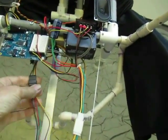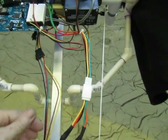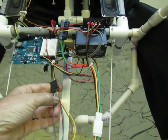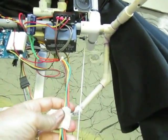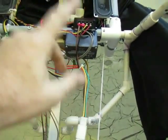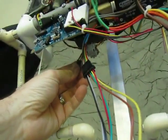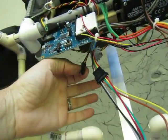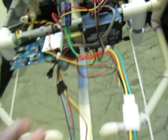The design allows for disassembly — there's a connector here that disengages the trigger and the audio. This connector is strictly 12 volts for all the converters and the amplifier. There's another connector that allows me to connect the pot for teaching, and I can disconnect the trigger here as well.